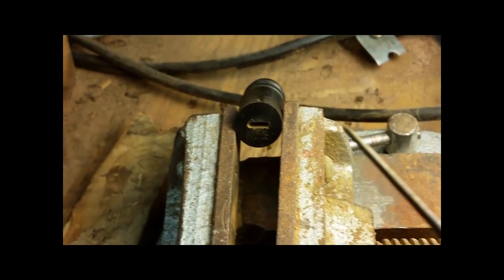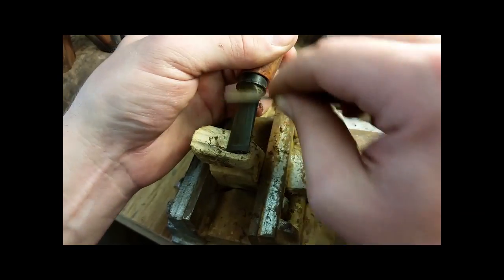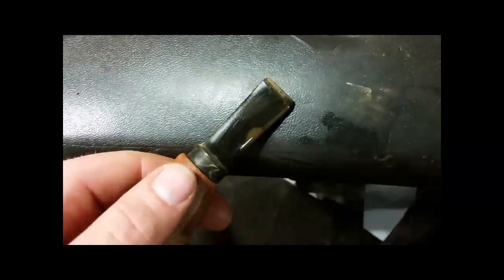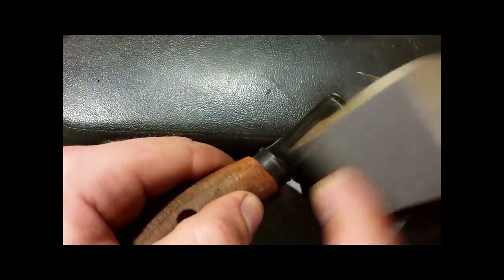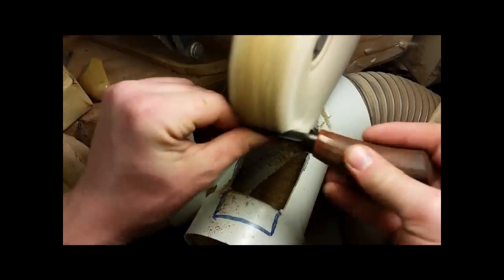Okay, so we've cut the slot, we've shaped it, and we've filed it. And now you get to sand it. And that's pretty fun. So once you've filed it, you scrape it and start sanding at 400 and move up to 600. You're doing this wet sanding. Then you can take it just like we talked about last week. You can take it red, white, wax with the buffing wheels. So then you have a stem.